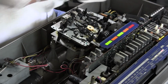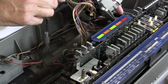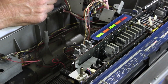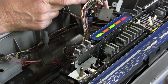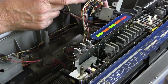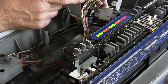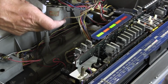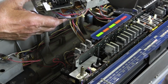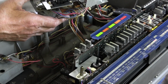I could tell, okay. What's there to see on the back side? Nothing. Because if you look here on the back side, here's the motor. But there's a bunch of circuitry for the motor as far as this is a dual speed motor. Meaning it goes a slow speed for the take-up reel when it's in play mode, and then a high speed for fast forward, and then a high speed for rewind. So it goes both directions, but this does not transfer this side or that side. It will move just a fraction of an inch, but there's nothing to help it to go to this reel or to go to that reel. So I don't understand it.